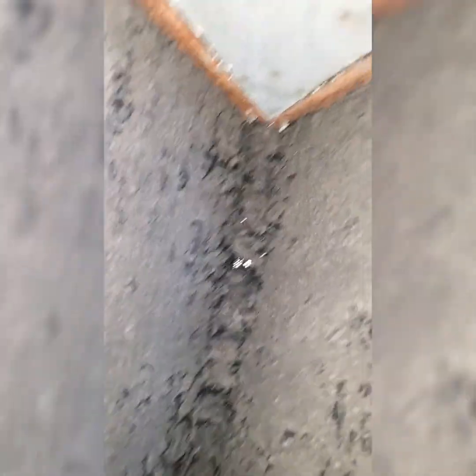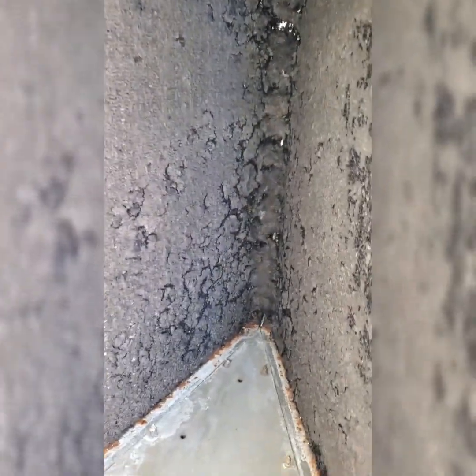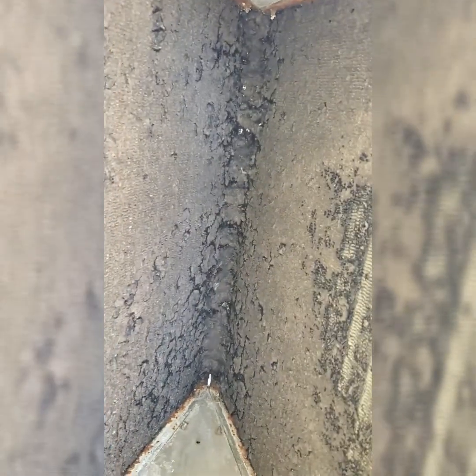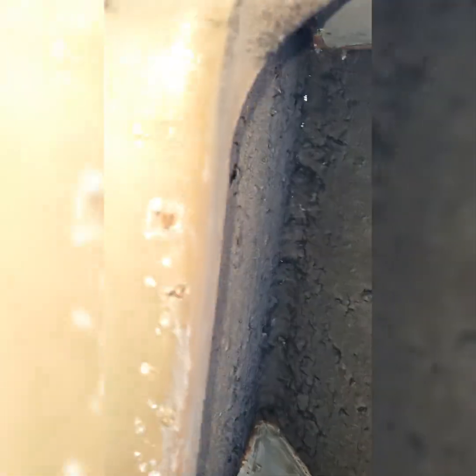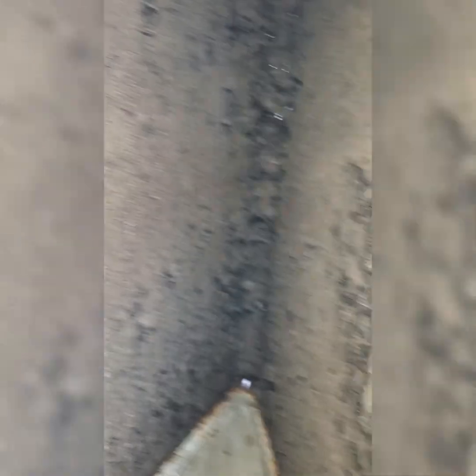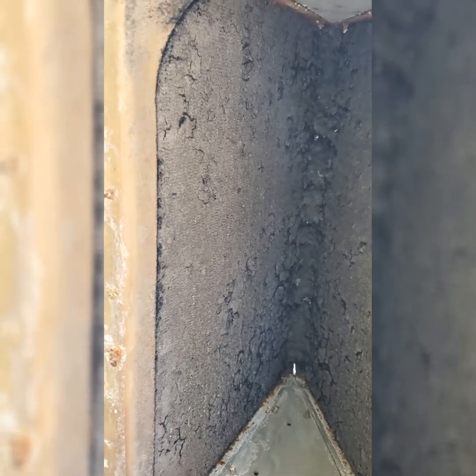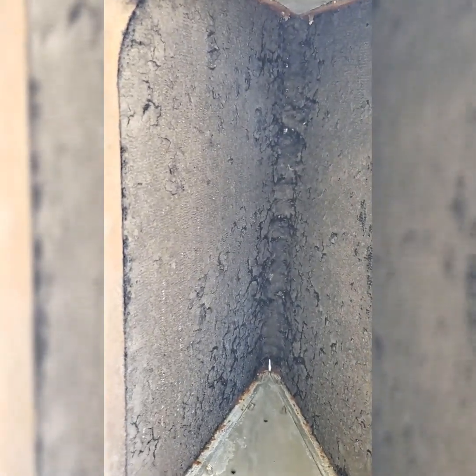I'm not seeing anything through there — not a thing. This is the stuff that gets me excited. This is nasty. This is what we've been breathing in. So I'm going to clean this out real good, spray it and clean it with actual cleaner. Outside total difference — that's what we should be seeing on the other side. So that's our problem: we have basically no airflow through this coil, and it's keeping it from cooling off the heat exchanger, just blocking all the air flow.